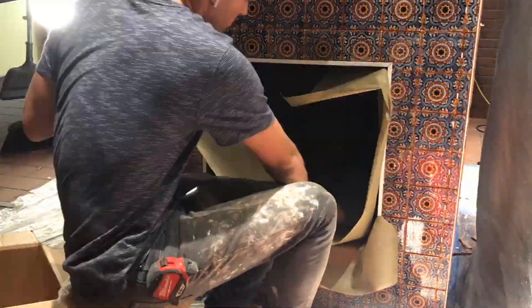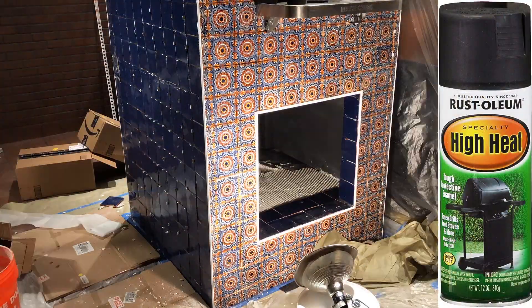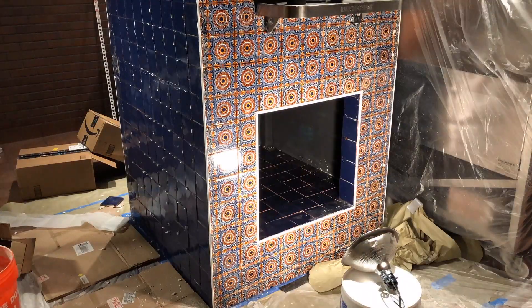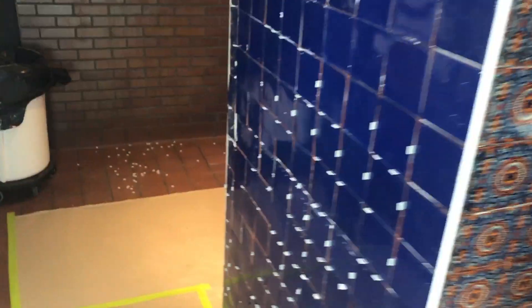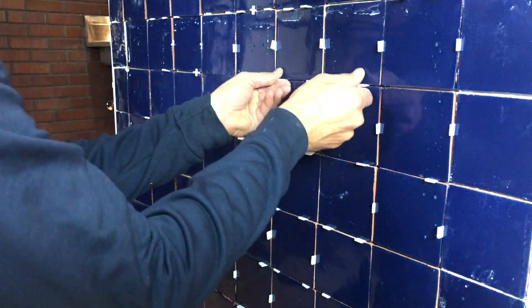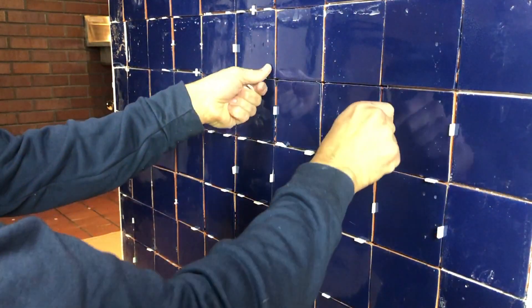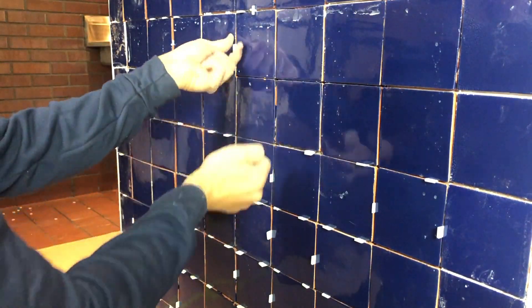For the inner walls of the wood storage, you're never going to see them, but just to give it a finished look, I sprayed black high heat spray paint in there to cover up all the walls. Then after that dried, I laid the tile floor so the surface looked finished and beautiful. After you let the thinset fully dry, you'll have quite the result — I used a couple thousand shims and wedges, so just keep in mind you're going to spend some time removing all of those.